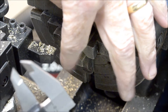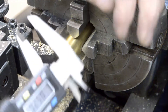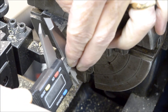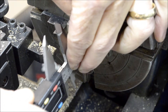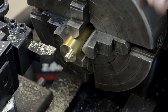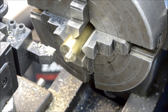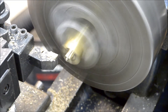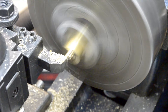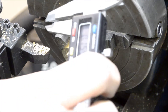Now this length here has got to be 5/32 of an inch, which is about 156 thousandths. Let's see what that is — we got to go in a bit on that, so we could take some of that off. Good enough.